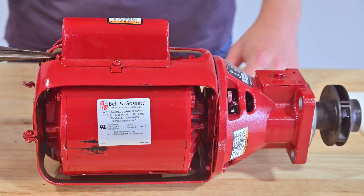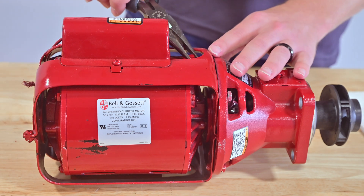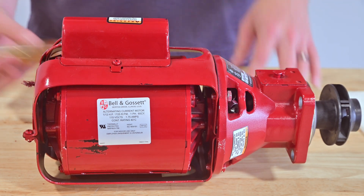Use the recommended amount as per manufacturer's instructions. In this case, for the bearings, fill it until it begins to weep from the bottom port. It will drip for about 24 hours, so place a rag below it.